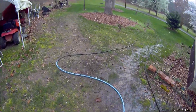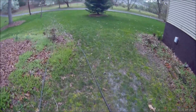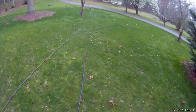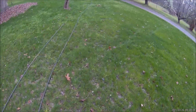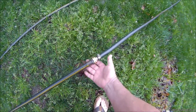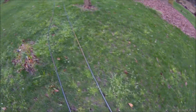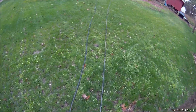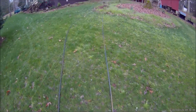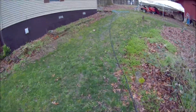Now at this point there's a lot more pressure on this black hose than there was when all I used was gravity to run water through it, so we'll walk down here and just make sure we don't have any loose connections or holes or anything like that. When water's just flowing like drainage, your connections aren't that important, but when it's got pressure, it does make a difference. I don't see any water leaking — the 100-foot hoses look good too. The only energy I lose would be the friction inside these garden hoses. If your delivery line was PVC pipe, there'd be less friction to worry about.